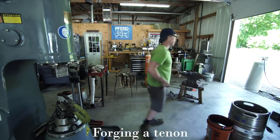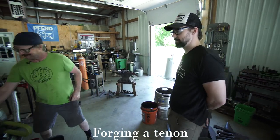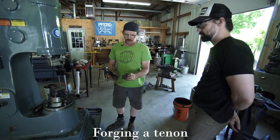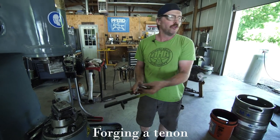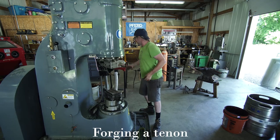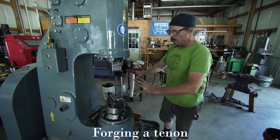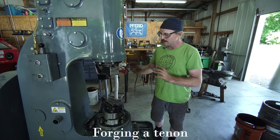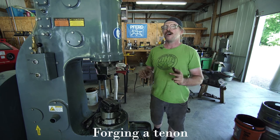Yeah, the joys of the saddle clamp. And I make all my tooling. Generally, I try and use the same size clips. That way, everything kind of drops in and out of that system really, really quickly and easily. So the kiss block's got that nice little handle, so I don't ever have to reach my hand into the danger zone. Definitely avoid, I never touch the die, ever. I never break that line. It's just a bad idea. That's when you lose fingers and things get crushed. But if I just never get in the habit of touching the die, that's no longer an issue.